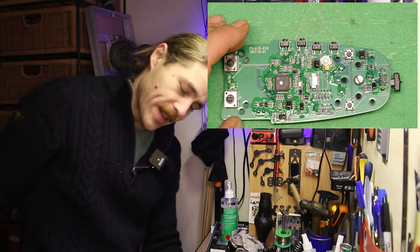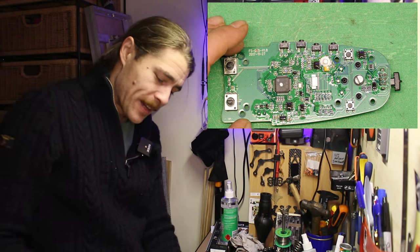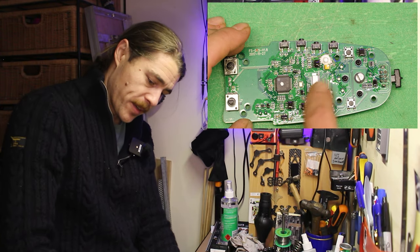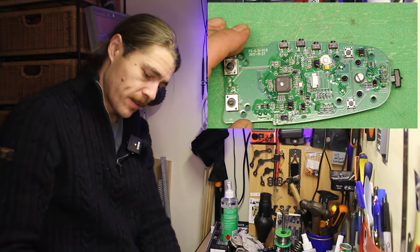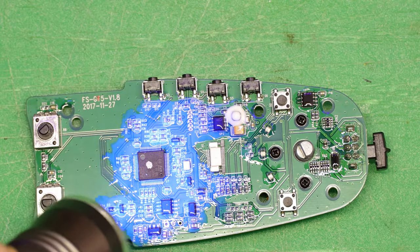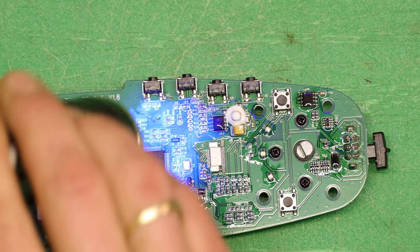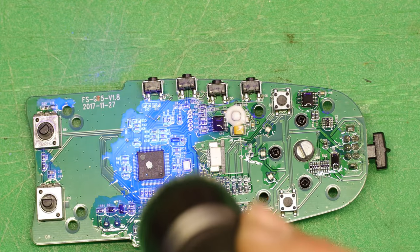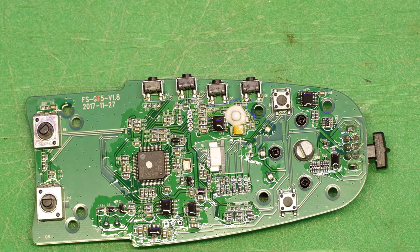Now, who noticed what just happened there? I almost dropped some of the goop in a bad spot, one of these two spots, or here. It'd be very bad. So finally, just want to check around that chip. Make sure all corners of that MCU are sealed up. And that's good to go. So now we wait for that to dry, and we can come back and do whatever we want to the other side, which is probably not much.